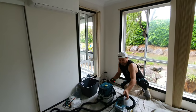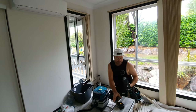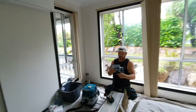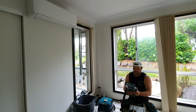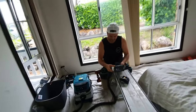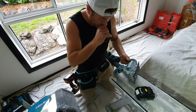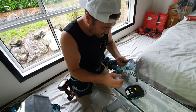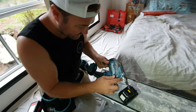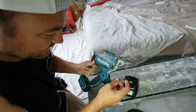So put the first battery in here. Actually before we do, coming closer here — we're going to set this blade to 13mm. So I'll show you how you do that. Just slide this off. And actually even without the vacuum, it catches a lot of the dust as well. It has little allen keys and a convenient little spot for them here.